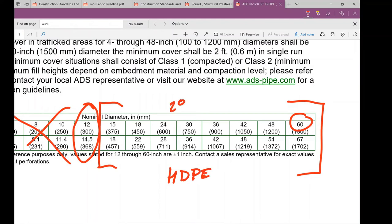Some manufacturers make pipe in sizes like 21, 27, 33, 39, or 45 inches, though not all carry every size. Pipe is generally sized in three-inch increments. During the design process you'll get numbers like 22.5 inches and have to decide whether to round up or down — either is acceptable, but each choice creates differences in the overall design.